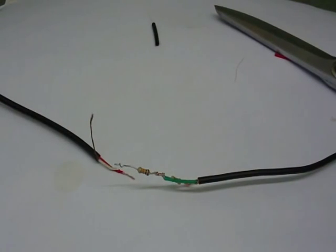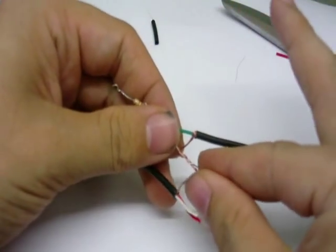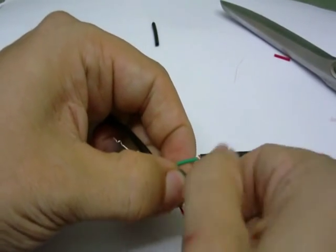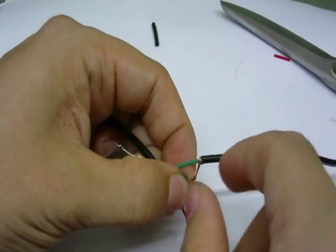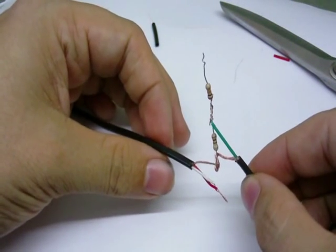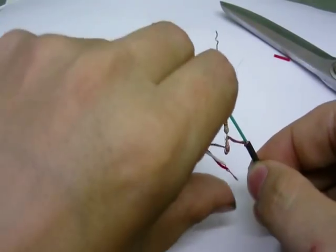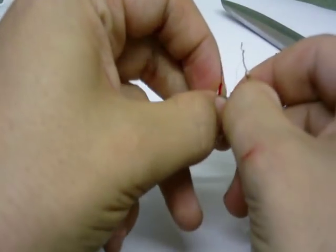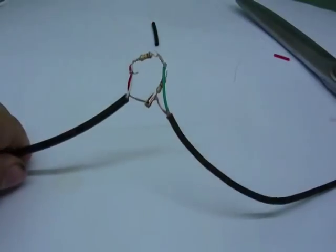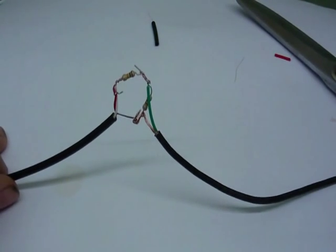Let's get them connected. Take the piece of uninsulated wire and connect it to the other piece of uninsulated wire on the other cable. The unconnected end of the other resistor — just connect that to the other two wires. And there you go — there's your attenuating cable, and it's now ready to be connected up to the tape recorder's head connection.